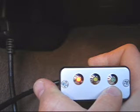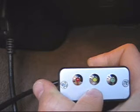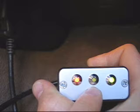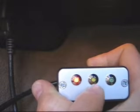You can see the green LED will still illuminate, but without any kind of connection, this yellow LED will only illuminate when you're receiving commands back from the EAS. In this instance, because I've physically disconnected the EAS, nothing's coming back.